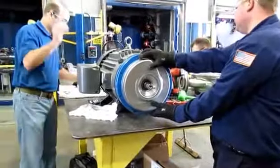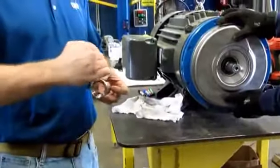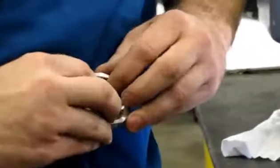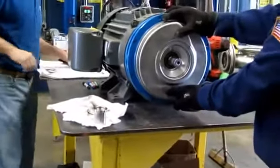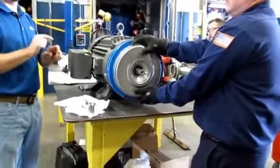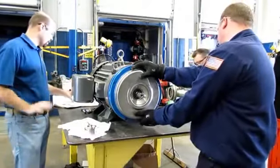The shaft sleeve — we cleaned that up. Don't forget to put the shaft sleeve O-ring back into the shaft sleeve — that seals between the impeller and the shaft from creating a leak path. Also note: keep track of your impeller nut O-ring and the shaft sleeve O-ring. They look very similar, but if you put the wrong one on the wrong hardware, it may not create a proper sealing path.